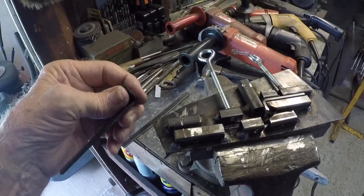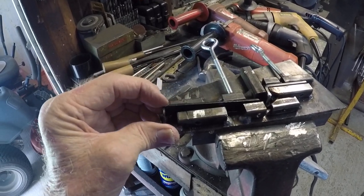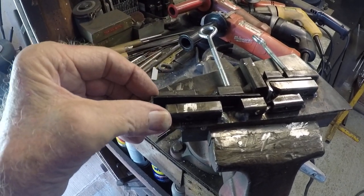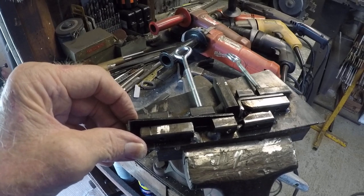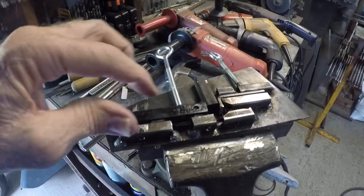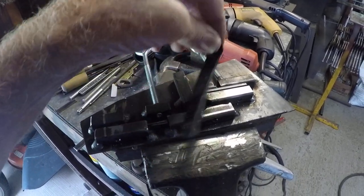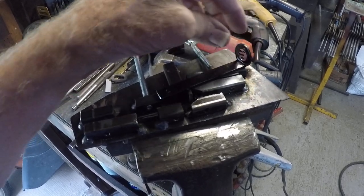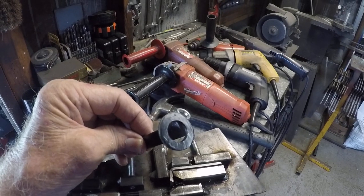In order to make the actuator or the cylinder holder, I have a section from here to here — that gives me my length, and there is my hole. I have to drill the hole through here. After I get done, I lay it on here, clamp it down, and weld a washer on the end that fits on the end of the cylinder.